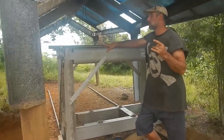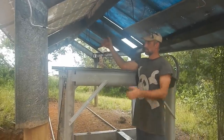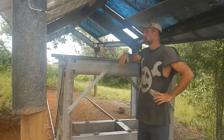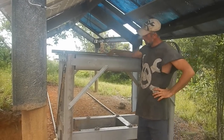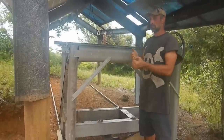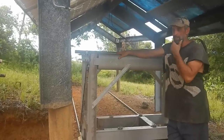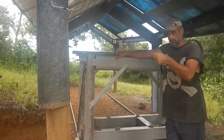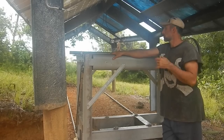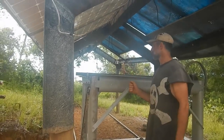However, I also want to be able to flip a switch or something and have three solar panels connected in series, and then another three solar panels connected in series, and then those two separate things connected in parallel — so then I have like a hundred volts. So I can run this off like 30 volts, but if I can do a hundred volts I can plug in all kinds of power tools, like a hot plate cooking thing — things that you plug into a wall socket that don't necessarily need alternating current. So I guess I should draw something and plan out what kind of switches I need to make to do that.